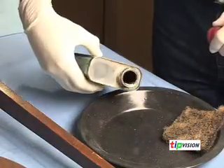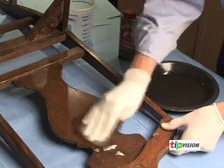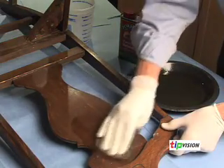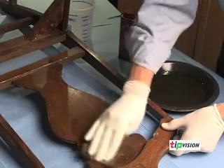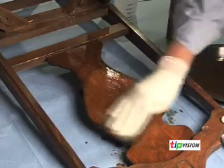Old pieces of furniture from the 40s and 50s often have an old shellac or dark lacquer finish, and as they darken they don't look as pretty as they used to. But it's easy to remove this old shellac or lacquer finish using a furniture refinisher. Simply pour the refinisher into a shallow bowl, then dip in either a piece of steel wool or a synthetic scrubbing pad. Working on a small section at a time, gently begin scrubbing off that old finish. The furniture refinisher will soften the finish and the pad will soak it up.